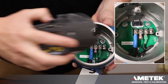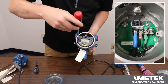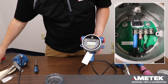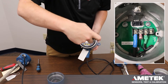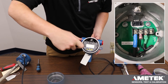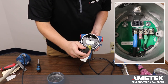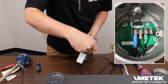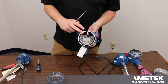Put your electronic module back into the condolet and screw these down. We don't want to go too tight — treat it like lug nuts. Start one, start the other, finish the first, and once it's snug give it about a quarter of a turn. Finish the second the same way. You don't want to over-torque these — you can break the display or the board underneath.